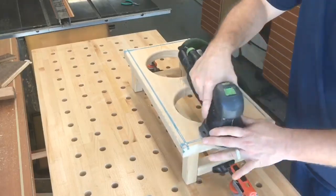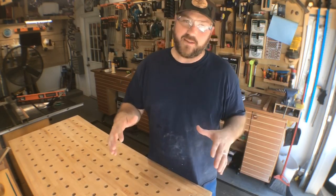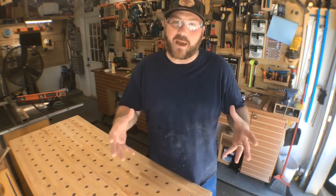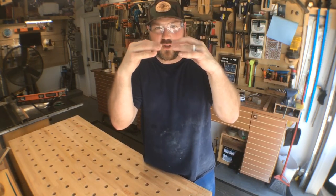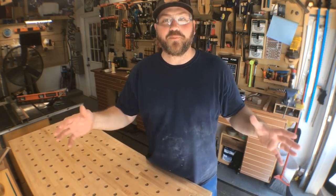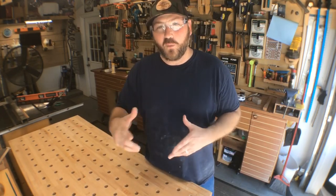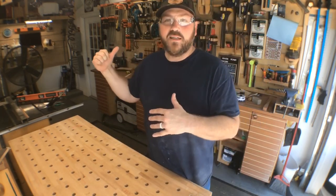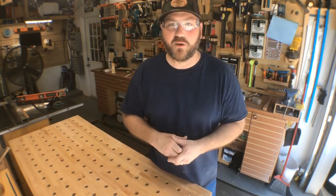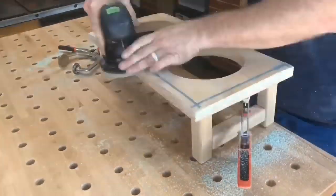This is woodworking for you - I made a big mistake. When I poured the epoxy, I didn't seal the grain first, so the epoxy seeped into the fibers and grain all the way down into the cuts. By the time I sanded through it, the epoxy was gone. I decided to use that mistake and change the design element. Using my Festool Rotex sander - the most expensive tool in the shop, invested in it eight years ago - I put it into Rotex mode and started grinding away the surface.